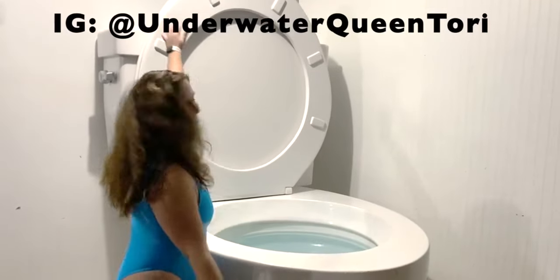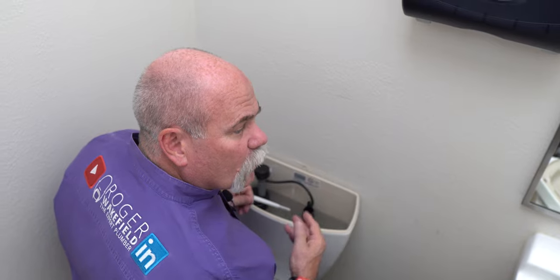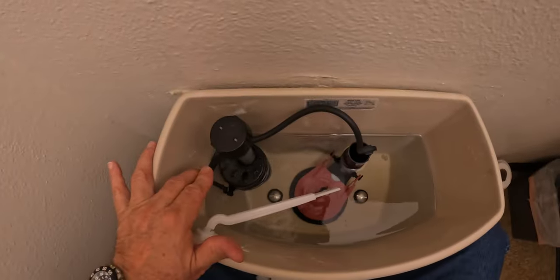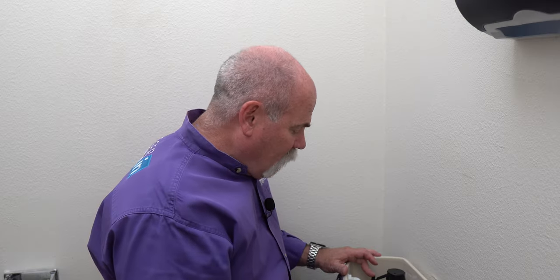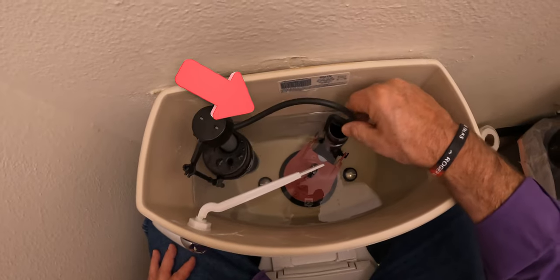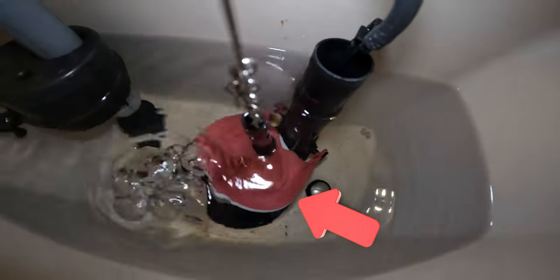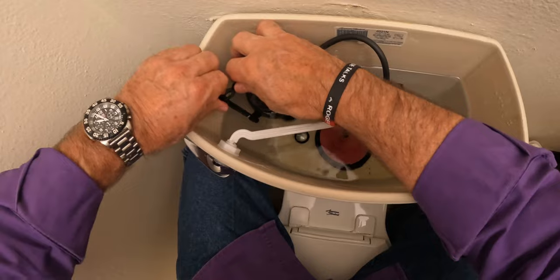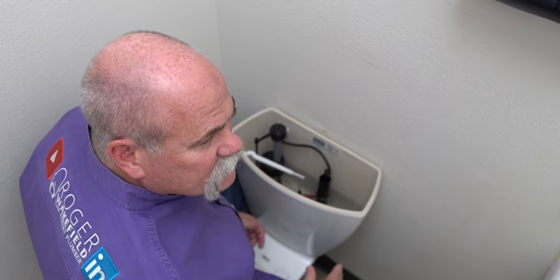Looking down inside the toilet, I can see the water level is adjusted low because the float screw is all the way up. Let me tell you all the parts. First, you've got the fill valve — that's what actually controls the water flow. If you push it down, you can hear the water running; that's like it flushed. Over on this side, you've got your overflow tube and your fill tube — this keeps your trap full. Down at the bottom, the piece that goes up and down is your flapper, and that flapper is connected to your flush valve. You actuate the valve with the handle, which opens the flapper and lets the water go down into your bowl.